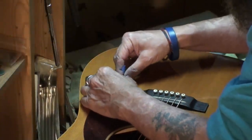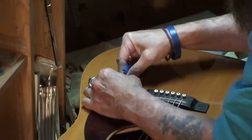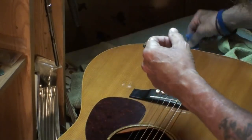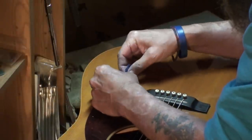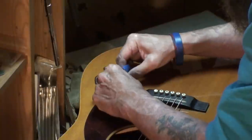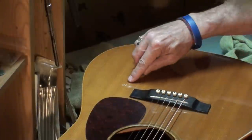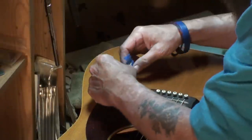Let's see if we can scrape it down a little bit. That's a pretty good hump so it's going to have to go a little bit at a time. The whiteness might disappear — I don't know if you can see that. Now we've got a bit of a burr on this, remember. You can see right there what we scraped off. I don't think it scrapes as well turning it this way, but it is — just not as good with that burr on there. I'm going to scrape in both directions anyway, because every time that blade passes over the glue it wears it down. It's taking it down and removing some of the white, which is good.